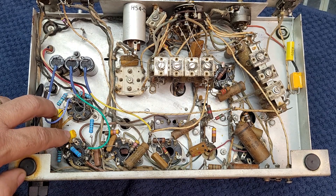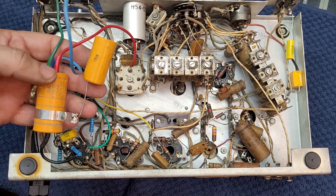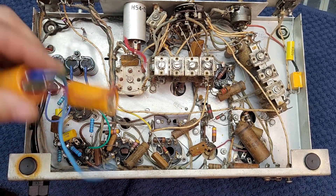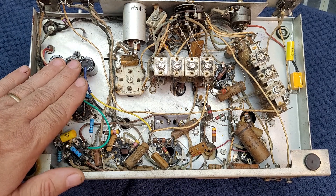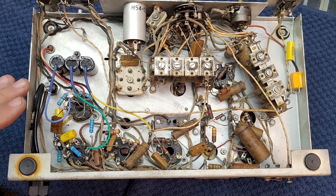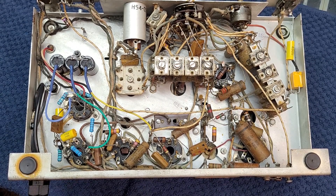There are also two new film capacitors here — this is our new filtering capacitor. We got rid of the big section they had cobbled in, and I have to say they had it wired wrong. I don't know if this radio ever really worked right after they replaced that unit — they kind of had it in bass-ackwards. So the rectifier tube and audio tube work is done, the filter supply is done, the capacitor to the case is changed, the safety cap is done, the new cord is in, the fuse panel is in, and the neutral is tied to the case. All the modifications from part one are now done.